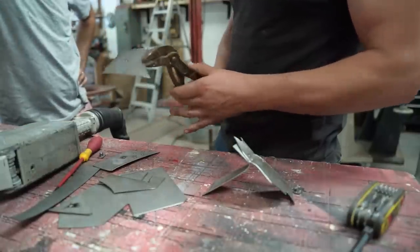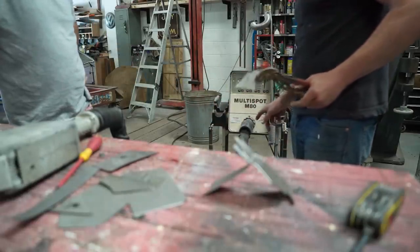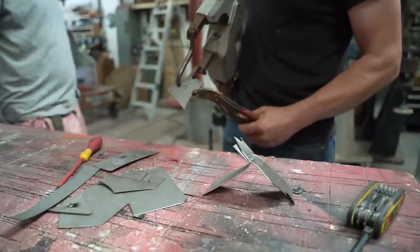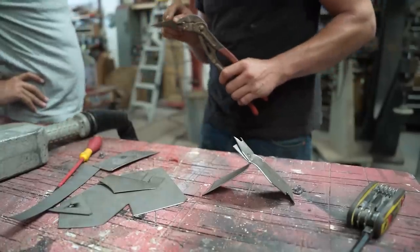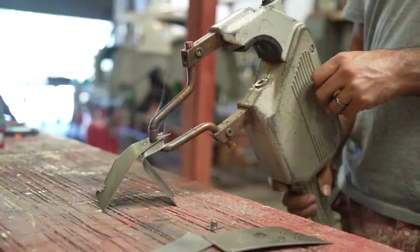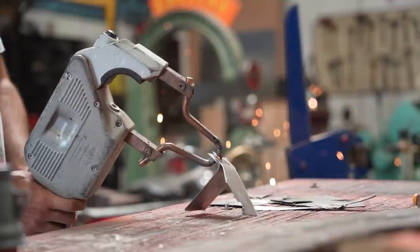We're only on 1.5, so maybe put the timer up to three. There's no like two mil, there's nothing in between. There's more sparks right on the edge - didn't blow through anything, that's nice. It's actually really consistent as well, we've done six or seven different spots. It's working really, really nicely. The jaws in at the moment - you can change them for rounded ones and pointy ones depending on what you're doing.